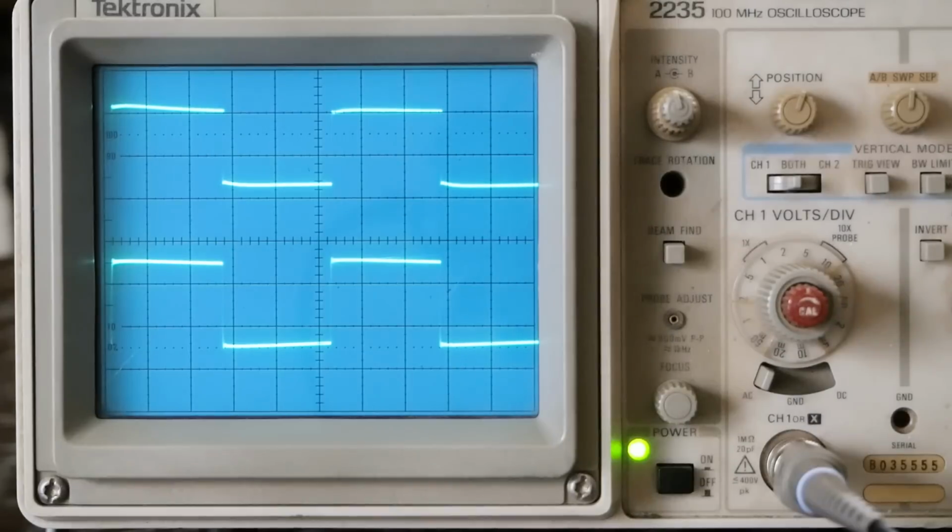So when I'm doing the frequency response curves on the audio analyzer suite, I'm going to have the defeat button turned in with the knobs all the way clockwise, which showed a nice flat square wave, and I think we probably are going to get a decent frequency response. Then we'll test it again with them straight up and see if that is maybe what Amir saw when he was testing this.